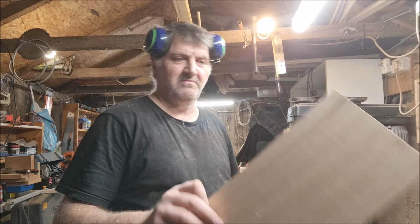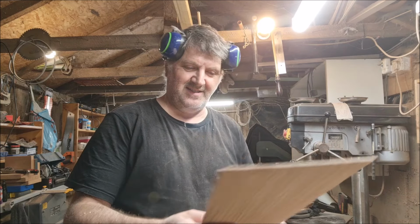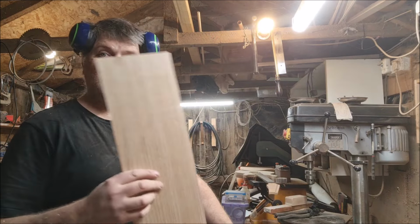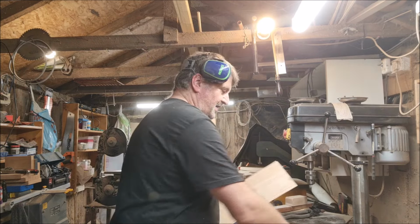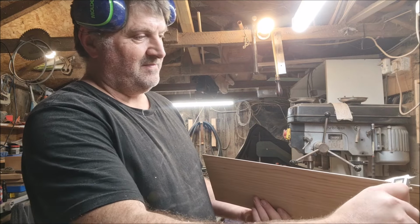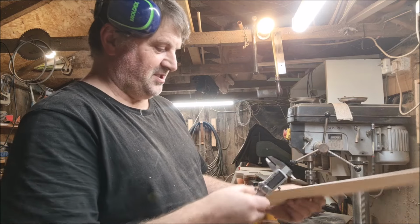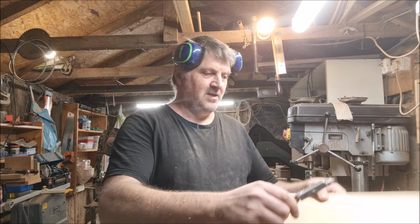Cavity cover wood, just over 5, and this stuff just over 2 millimeters for the headstocks and things. Good stuff. Use that melamine board in the planer, you can get it really, really thin. So, that's like 2 mil. Let's see what's here. Yep, 1.97 to 2.14. Oh, this thing's got a snipe on, that's what it is. So, 2.14 millimeters or so. Brilliant. Anyway, stick it on, eh?